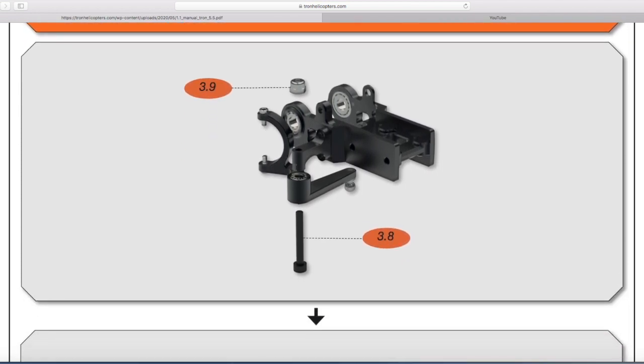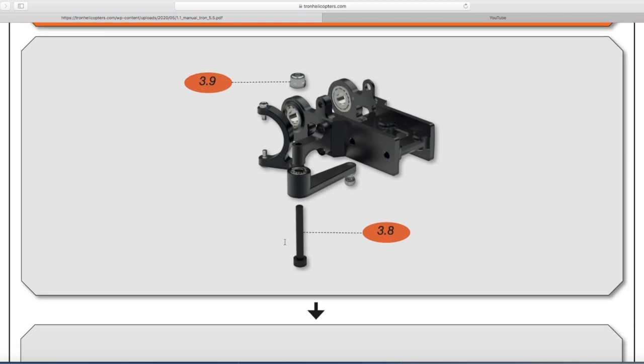So see how they've got everything pre-assembled here. I really love how, so you'll Loctite this because it's going to be threaded throughout here. Do not overtighten this. Just get it locked down. Make sure that your arm is going to be nice and free, and then sink on your lock nut. Now these are nylon locking nuts, so you don't need to apply additional Loctite. So everything will be fine there.